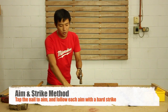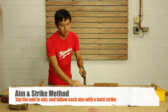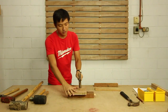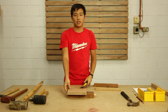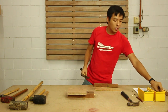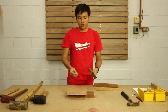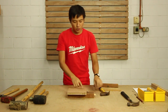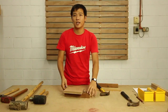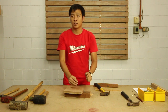While you're hammering, there's a technique to it as well. There's an aim-and-strike method you can use. So that's how we sink a nail with the claw hammer. I'm going to show you how to remove a nail as well — once it's bended or something. This nail is a bended nail. When the timber is too hard, as you knock, if you don't go on the axis, you actually bend the nail.